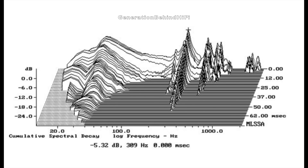Before I get into testing the cabinet, I wanted to show you the spectral decay plot that Stereophile did on the KEF Q350 to see if it matches with my measurements. So what is spectral decay? Cumulative spectral decay, or CSD, gives a detailed analysis of a loudspeaker's resonances. As you can see from the spectral decay plot that Stereophile did on the Q350, there are several resonances showing up — one at around 300 Hz and another between 600 and 700 Hz.